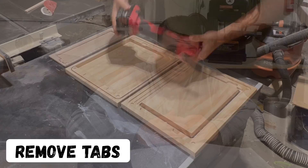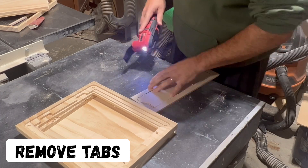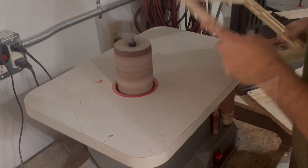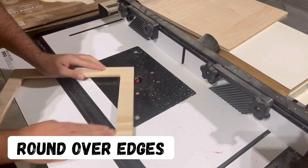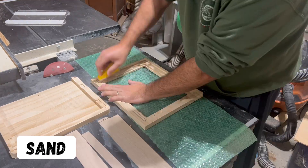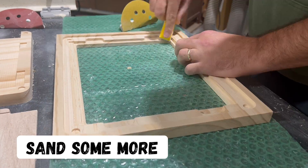Chapter 5: prep and assembly. Now that our components are carved and off the machine, we can start prepping them for final assembly. The first thing we need to do is remove the tabs, and I found the easiest way to do this is by using a multi-tool. I then go over to the spindle sander and make sure the tabs are completely flush with the edges. I do use my router table with an 1/8 inch roundover bit on the front cover, making sure all edges are rounded over on both the inside and outside of the component and also the middle edges of the actual frame. After I'm satisfied with the edges, I get to sanding — using up to 220 grit sandpaper on the pine, just focusing on the edges to make sure they don't look too rough.